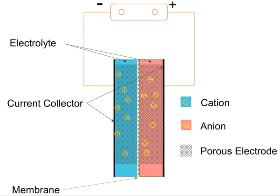The measurement methods employed by individual manufacturers are mainly comparable to the standardized methods. The standardized measuring method is too time-consuming for manufacturers to use during production for each individual component. For industrially produced capacitors, the capacitance value is instead measured with a faster low-frequency AC voltage, and a correlation factor is used to compute the rated capacitance. This frequency dependence affects capacitor operation. Rapid charge and discharge cycles mean that neither the rated capacitance value nor specific energy are available. In this case, the rated capacitance value is recalculated for each application condition.